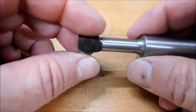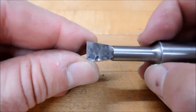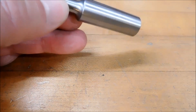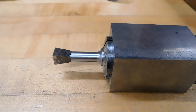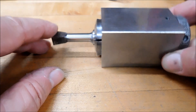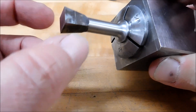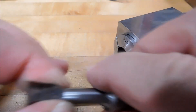Same kind of broach, this is a 17-4 stainless broach. I know this because of the color - you can see the browns and the blues. This heat treats at 900 to 1000 degrees depending on the heat treat you're looking for, but H900 is 900 degrees. This is an easy one to make: take a collet block or indexer, turn yourself up a blank with a large relief and a big head on it, put it in your vise, tilt the back to introduce the front rake angle you want, and mill the flats. Don't make the rake too aggressive or the edge will be very brittle. Make sure whatever footprint you have on the front takes you all the way past whatever relief you put on there. I think this is the one I'm going to use today.